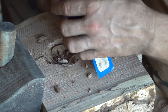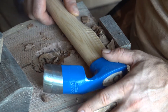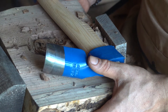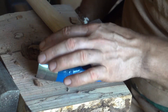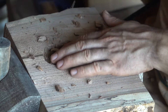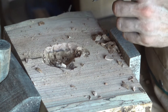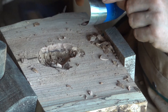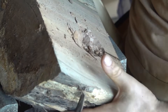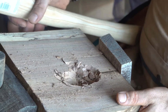I also want to say I haven't sharpened any of these. A lot of these blue adzes coming out of Europe — whether it's Mueller, Ox, Geodor, or others — are going to need finishing to whatever you prefer. That's really a non-issue. This one I've not honed or sharpened — you can see it's fairly roughly ground, and that's just the nature of the beast. Your higher-end adzes, like the Seven Pines, are going to come in a little bit sharper, and that's really going to help you out.